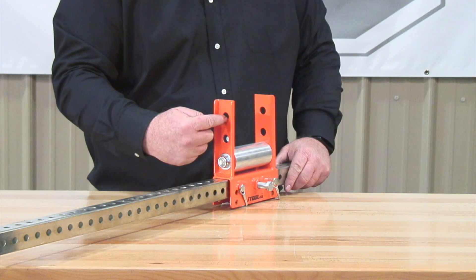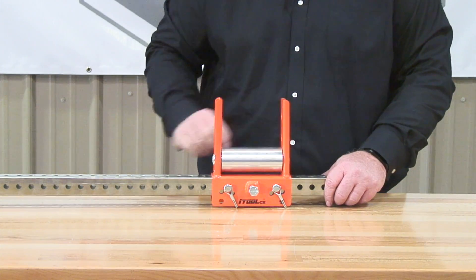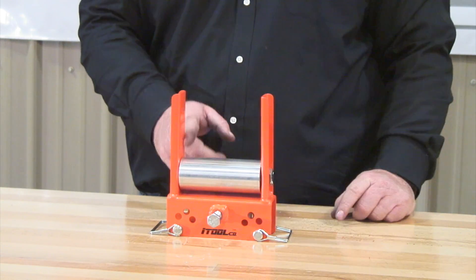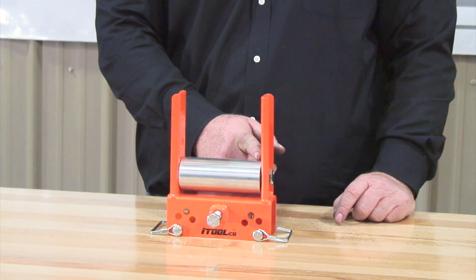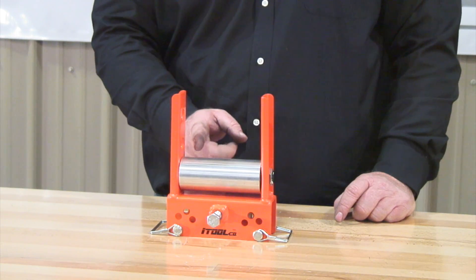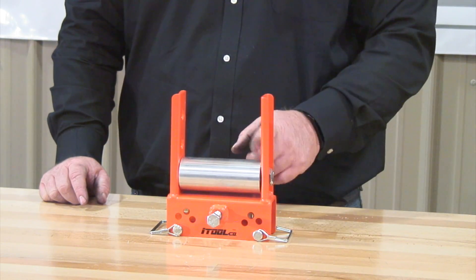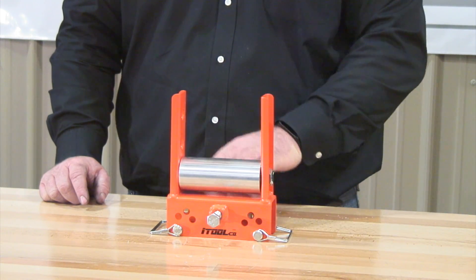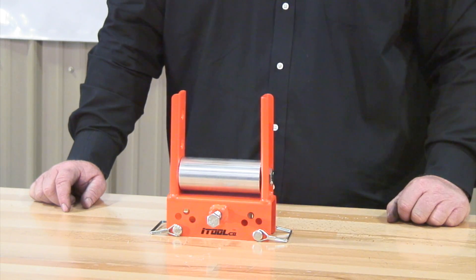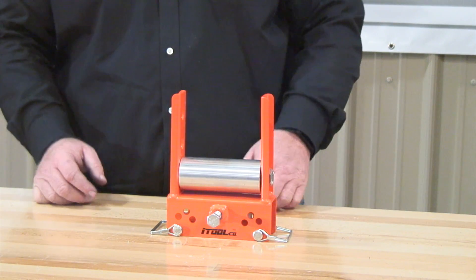Also going to notice that the rollers are adjustable. If you want to adjust the height of your rollers to be higher as it goes down the tray, you can do that. One of the other things you're going to notice is a solid aluminum five-inch roller. We went with a solid aluminum five-inch roller rather than skate rollers because when you're pulling wire and the load gets heavier, the rope tends to get in between those two bearings on the skate rollers, and that will blow out your bearings. So that's why we went with a solid aluminum roller with nice steel construction. It gives you a five-inch rolling surface, about eight and a half inches tall and about two inches overall width.